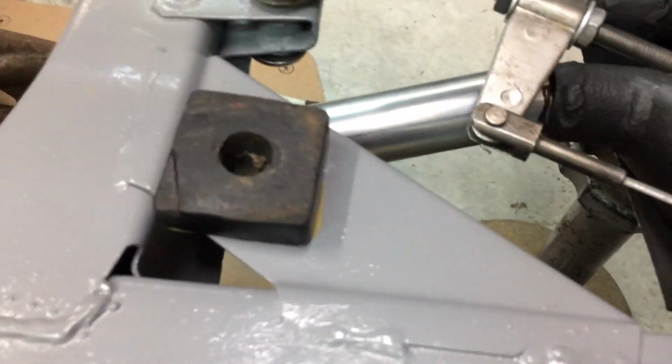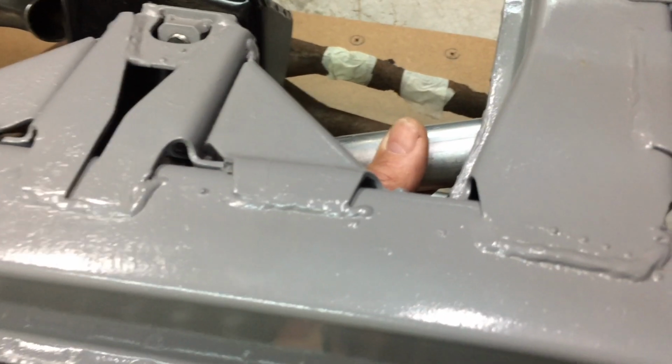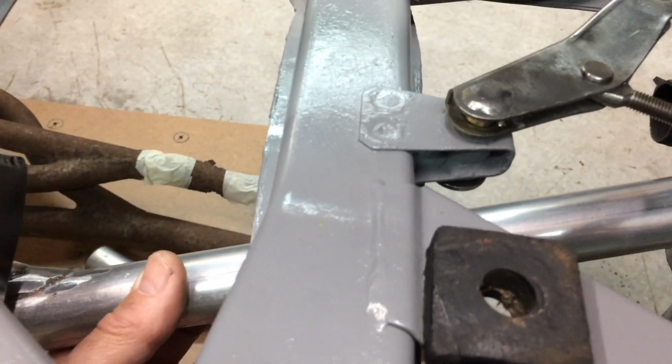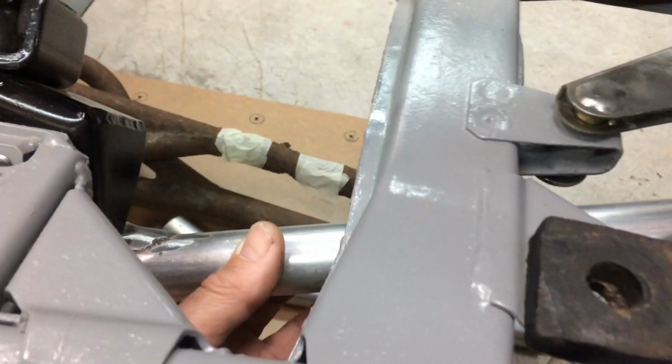What I've got to do is shape these, and I'm going to weld that to there and aim it over towards that. This will go to number 4 pipe, and the V of it will go to number 1. I've just got to chamfer it and make it fit better. And I'm going to do a similar thing with the other one, just link it up to 1 pipe, then I'll drop it down and get the rest of it happening.